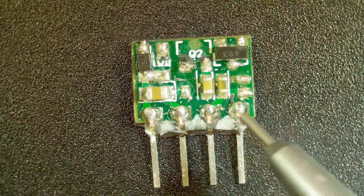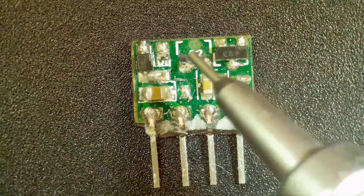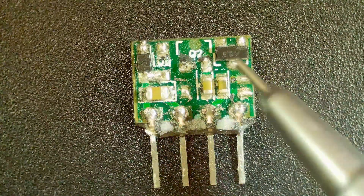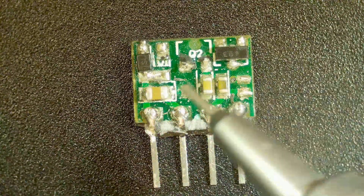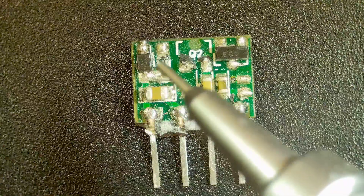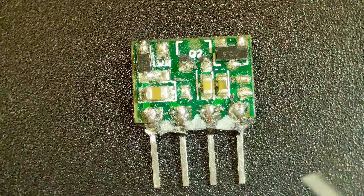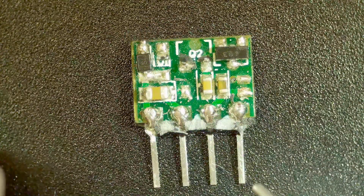You can see here it's not very complicated inside. It's got the four pins — input and output. It has two transistors; this one got broken off when I opened it up, so it had a transistor here and one here. It had some capacitors and has a diode here — looks like a Schottky.